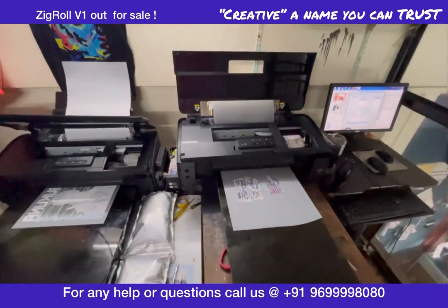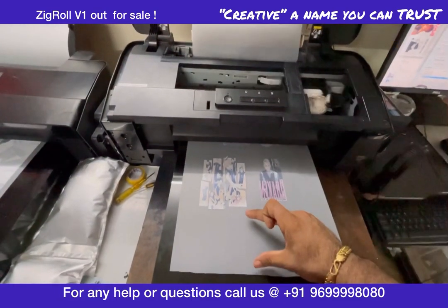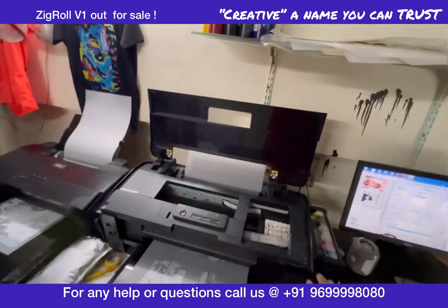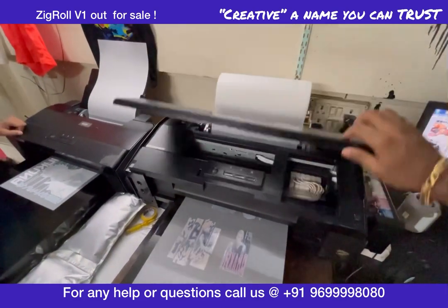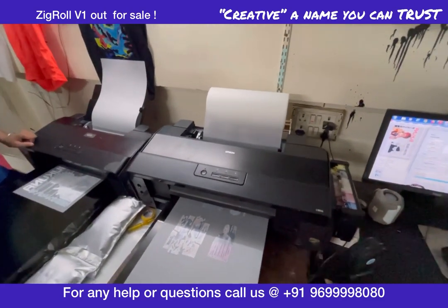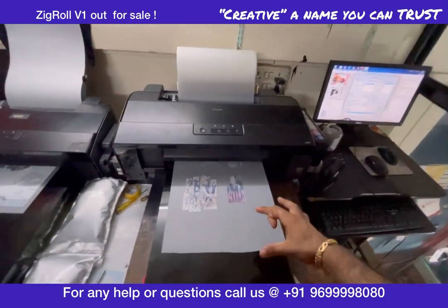How will this printer work with the software attachment? In the morning I showed you how to feed the paper, but some paper goes to waste every day — you don't have an option for that. What you can do is put the paper in front to reduce wastage as much as possible. In this roll-to-roll printer, you don't have buttons to take the paper out or put it back in. You will eject the paper through the software only. You don't have an option to insert the paper inside again or rewind the roll. For that, you have to buy a modified printer. But if you have a continuous job — if your printer runs all day and you have non-stop work — then this much wastage is acceptable.